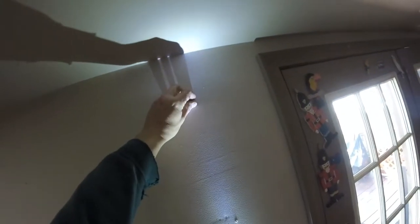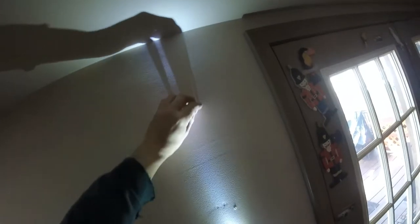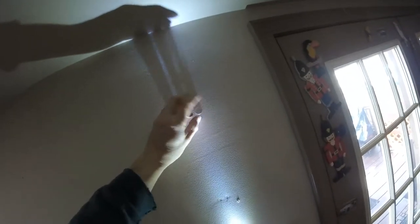But generally you take a flashlight. In most homes you can see nail impressions. The guy here, he was a body man, so he was really good. I can see an indent right there, so I thought maybe there was a nail. Oh, I got one. Okay. Obviously, most contractors, you know, you got a stud. So this outlet's on the left side.